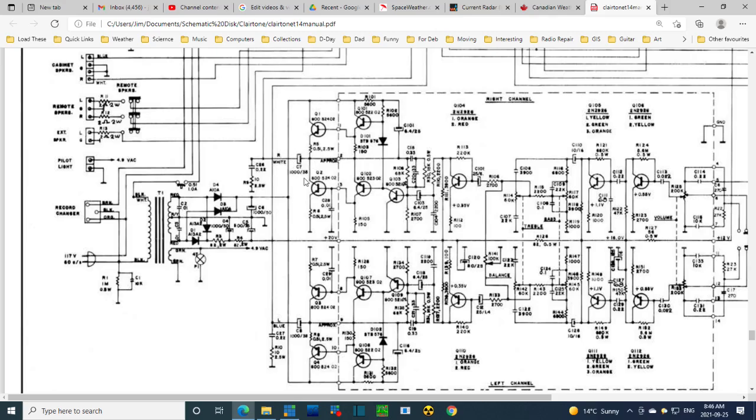This is a lot cheaper than having a transformer here, which takes up space, consumes energy, weighs a lot, costs money. These are still fairly large. They're thousands of microfarads. And their job is just to let the audio through with enough strength to drive the speaker. That's why they're so large. Now the one I replaced is one of these two. I think it's this one, number 8.